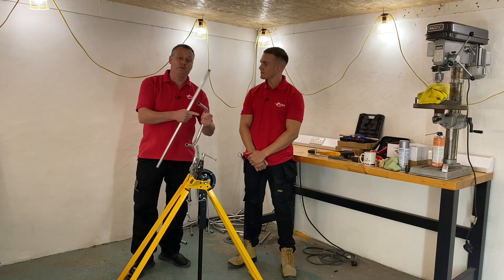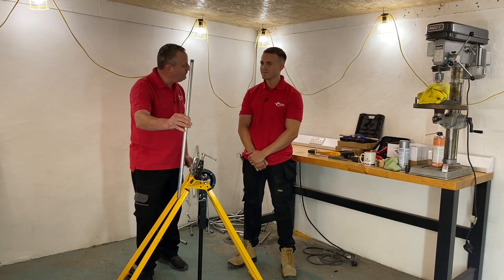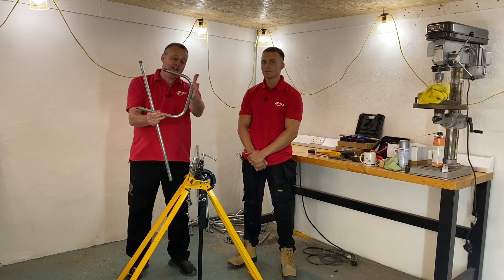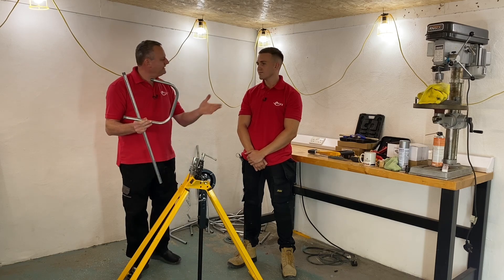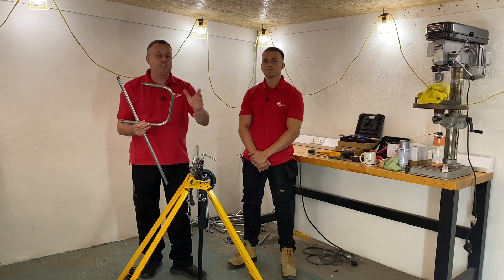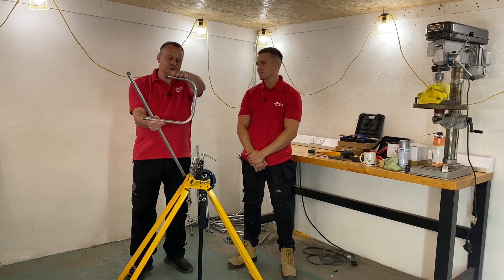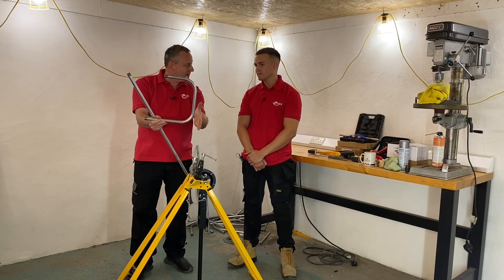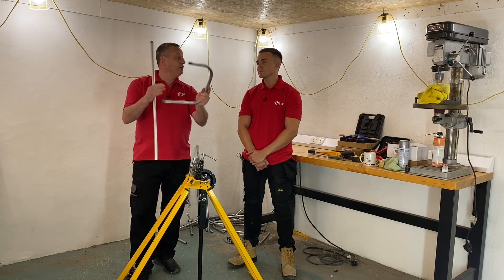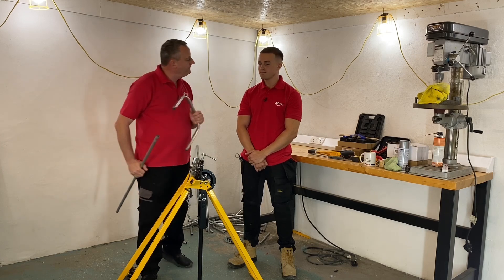In this video I'd like you to replicate what I did. I've already done the hard work — I've cut the conduit 800mm long and put a thread on one end. What I want you to do is from the back of the bend to the end of the conduit, that's to be 200mm. The new technique for this video: back of the conduit to back of the conduit to be 300mm. That's what's been requested, and then you'll need to cut and fabricate whatever conduit is left over so you perfectly match the one I've done.